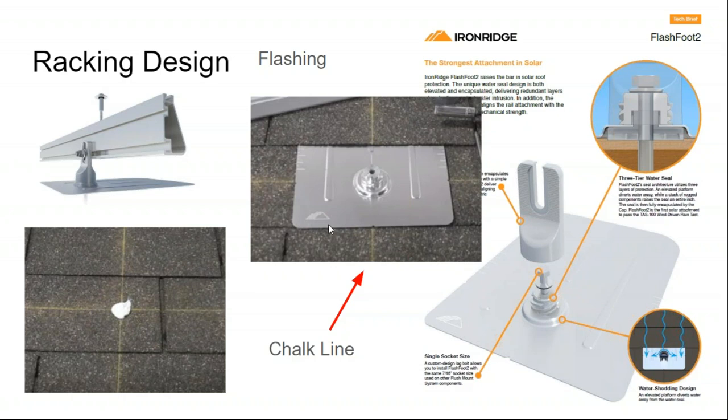There are laser stud finders that you can use to identify these rafters. There's a little bit of a trick to it. You need to take a thin flat surface to put on the rooftop because the shingles throw off the stud finder. And the other trick is you can't use a $40 stud finder. You've got to use a $500 used, $800 to $1,200 new stud finder, one that has enough depth to get through the roofing surface into the rafter. So there are even more professional ways to identify where the rafters are than just hammering the rooftop.